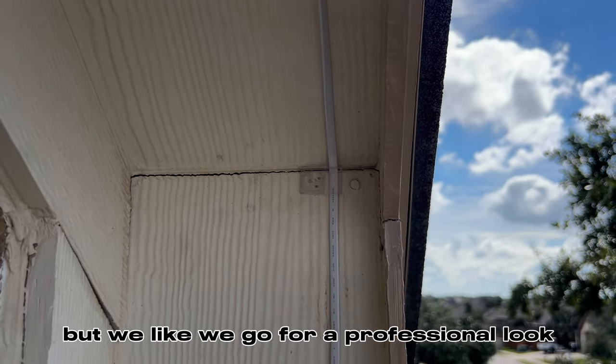All right, there's a truss running right here. You can see that there's a light bolt there that has drilled into that. So we're gonna be drilling right in here. And I went up to the attic and I verified if there's any electrical cord there, and there isn't. So here we are. And there you go. So that's where we'll stub out with the power plug.